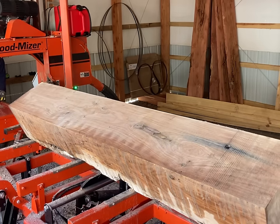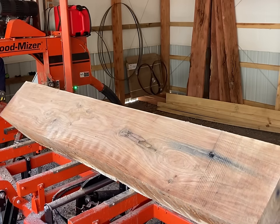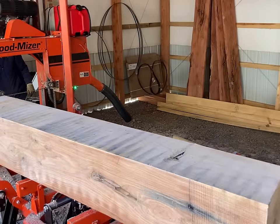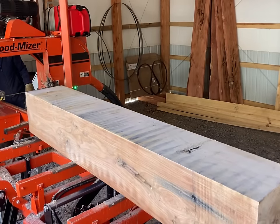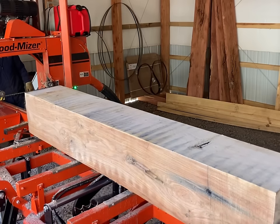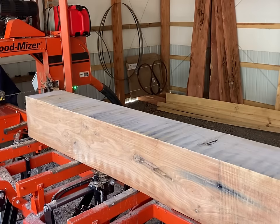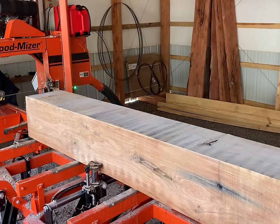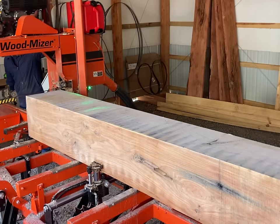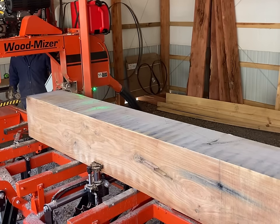The side we were cutting on — that was going to be my final cut. If that nail would have been another half inch deeper in the log, we would have gotten off of that side before we hit it. The reason I was stopping was you can see that blue stain coming up, and the juvenile wood is wandering through the log. In the middle there, you can actually see the juvenile wood coming out on that cut.